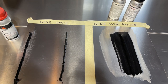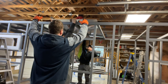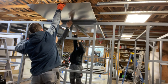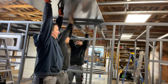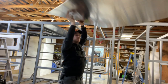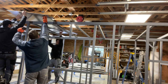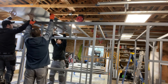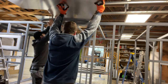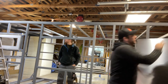The first thing we did was setting up all the aluminum sheets on the roof in position with their cutouts and everything. Then we marked from the underside with a felt pen basically all the horizontal running roof rafters on the underside, so that after we took them off and put them on the work table, we could see where the rafters actually are and where the structure is on the sheet — so we could sand and prime the right spots.